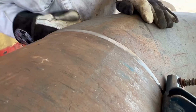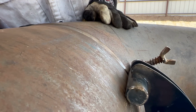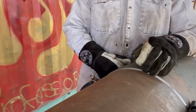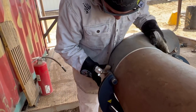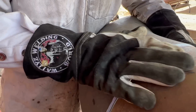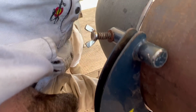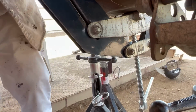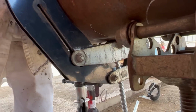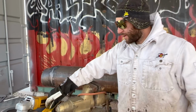It's a little bit of high-low on the fitting to the pipe that you can see. Sometimes that's just inevitable. You can't get away from it. You're going to have high-low, you're going to have egg-shaped pipes, and the best thing with the Ultra Clamp is you can somewhat squeeze it out of there and try to make it work. That's all I'm trying to do, just split the difference, make it work for me, so that when I sink my bead inside of it, it's equal all the way around, and it's not high-low on one side or the other, because when they put the X-ray film to it, they will see a shadow cast there if it's really high-low.